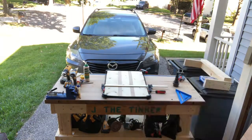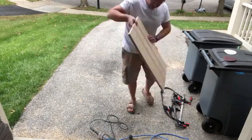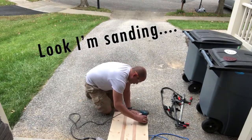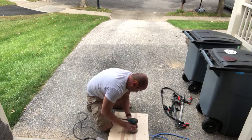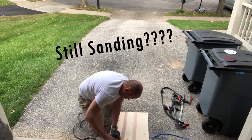Some additional clamping is handy but not necessary, as the glue will set in less than two hours. As for the next step — you guessed it — sanding, sanding, more sanding. I want all the edges to be soft as skin. This is your opportunity to find any imperfections and smooth them out. Ensure that you start with 80 grit and work your way up to 180 grit. The orbital sander does the trick every time.